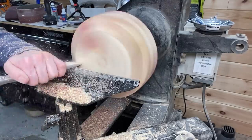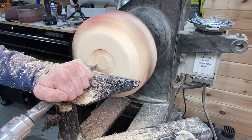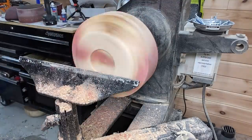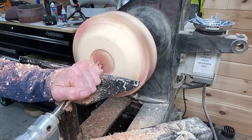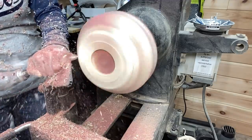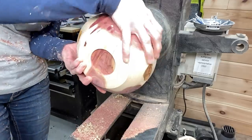I switched over to the skew chisel here to flatten out what will be the bottom and start to make the marks for the foot, which is going to be a recess or mortise. Trying to make it pretty simple here because I want the cedar to really be its own art form — it doesn't need a fancy foot or anything. Back to the bowl gouge, making the curve around the side, making sure the mortise is deep enough, and back to the side to get it to the shape that I want. Stopping in between to check it out and making sure there's a flat part on the bottom for the foot to sit properly.